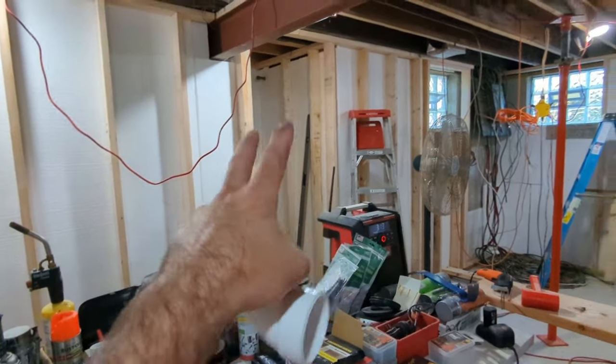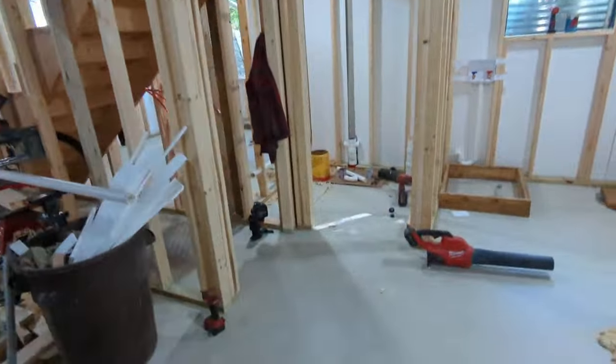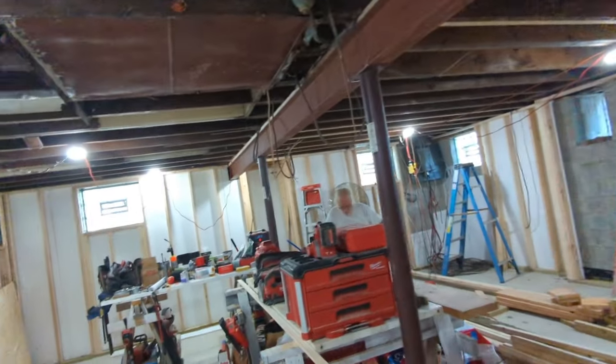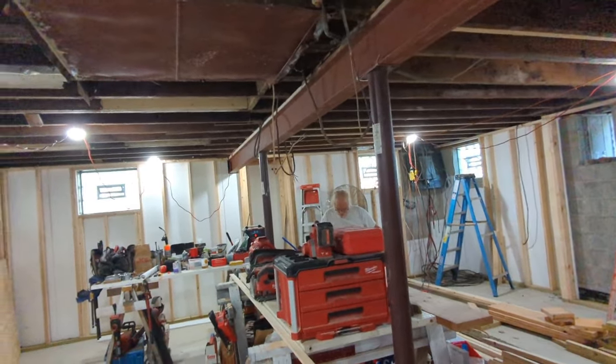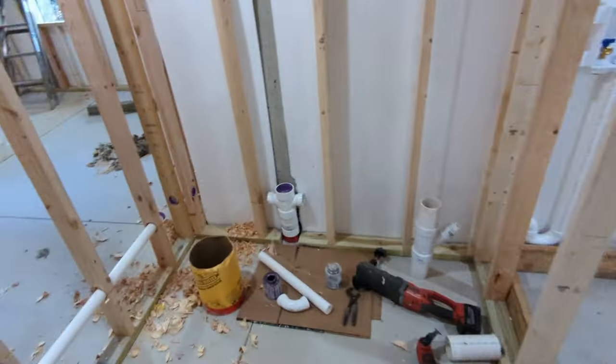Really cool to think we could get the combi unit and all the utilities in there, and then just come along here to supply everything, run this floor, run the first floor radiant heat above us, and then do maybe radiators on the second floor, which is going to take advantage of this PEX that we put in. It's just going to be about the same price to reset up the whole forced air unit.